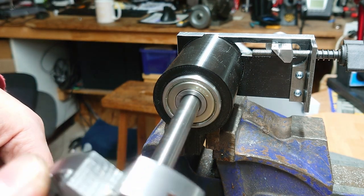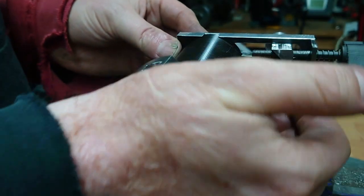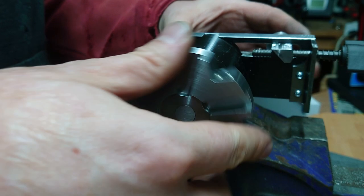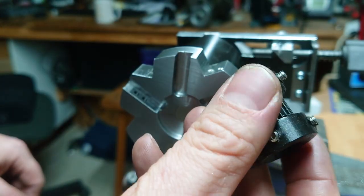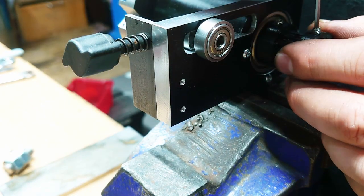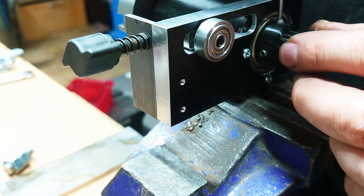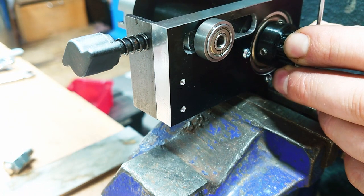Inserted the cutting head, and then we've got the pulley that goes on the other end to clamp that in place, basically. I managed to get 4 grub screws on this one, that's why I grew the 2 flanges out, just so that I could get a lot of grip. Again, if it was done properly, I'd key everything onto the shaft so nothing could slip.